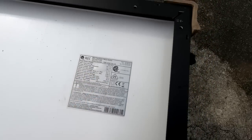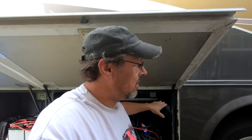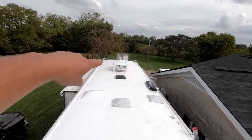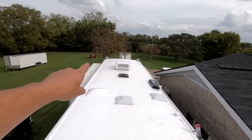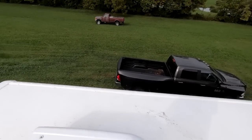So we got all of that there. I'm mounting four of the panels going to the inverter and lithium batteries; the other two panels are going to go to the coach batteries. Once I get the panels done, I've got to run two sets of wires down. The two panels go to this side, four panels go to the other side. My goal is to run them all down the refrigerator vent, come down to the floor, across the basement area. I'm putting two panels in front of that other air conditioner, one here, two here, and the last one there.